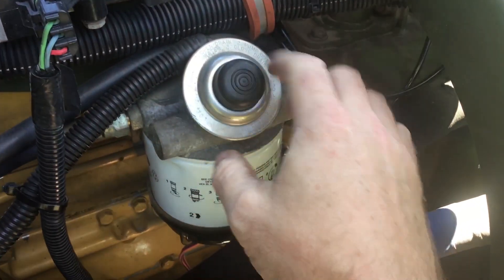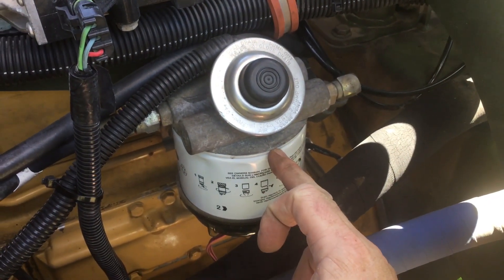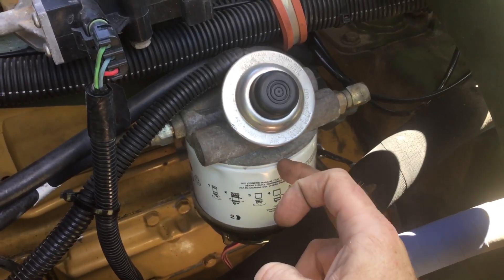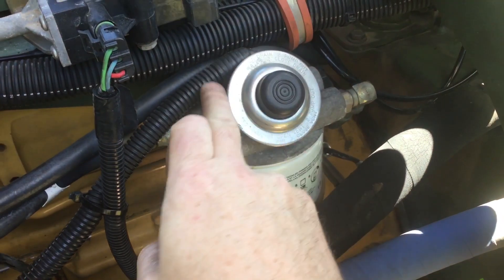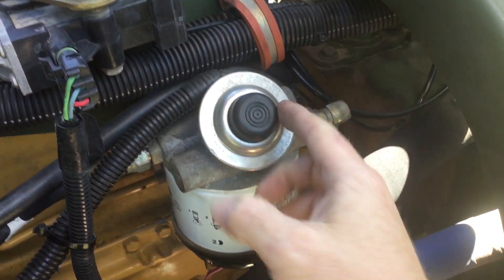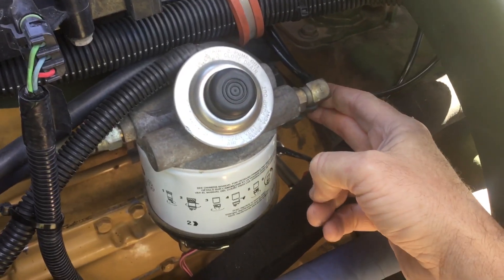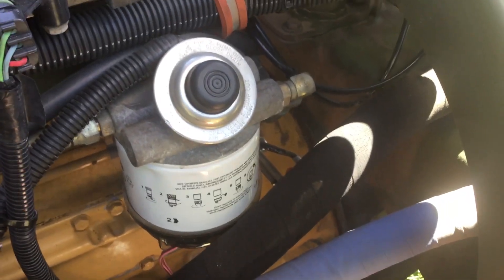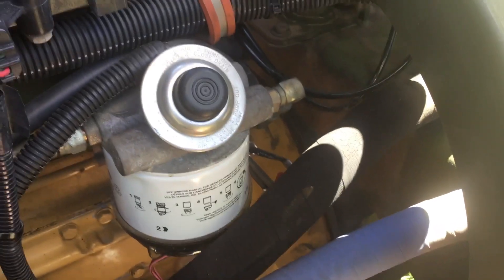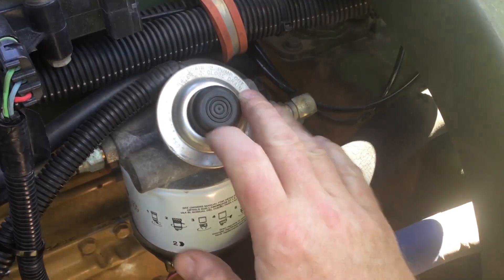If it's easy to pump and you just keep pumping, it's probably not lifting any fuel from the tank. One of two things could go wrong if you have a leak in this assembly: one of its internal check valves is bad, or this little flapper valve is bad. If this flapper valve doesn't close, you'll suck fuel or air from the filter body up through the primer, pump it right back down into the filter, and it'll just loop right here and not move any fuel. Another problem: if you pump it and it won't get firm, you have a vacuum leak somewhere back to the tank. This plumbing has to be able to maintain a vacuum to lift fuel. It's way easier to suck in air than to lift the weight of the fuel. Any kind of leak — old cracked lines, loose fittings, anything along that pathway back to the tank — and this thing won't lift fuel.